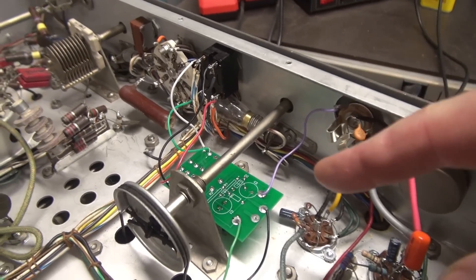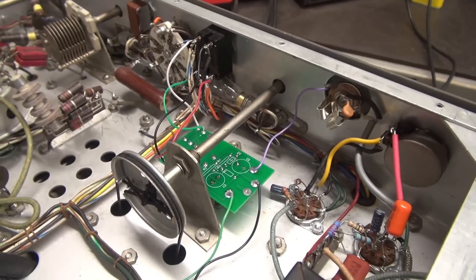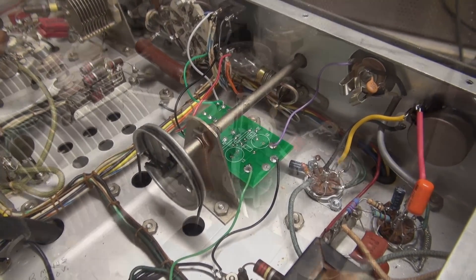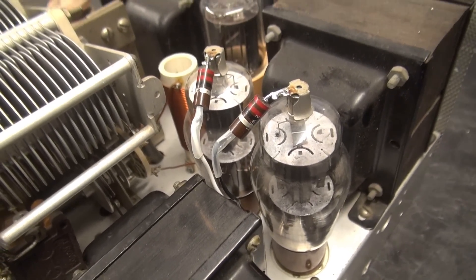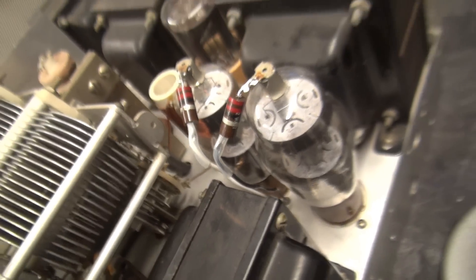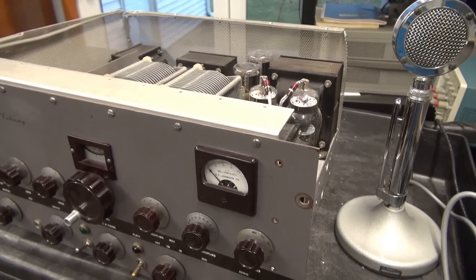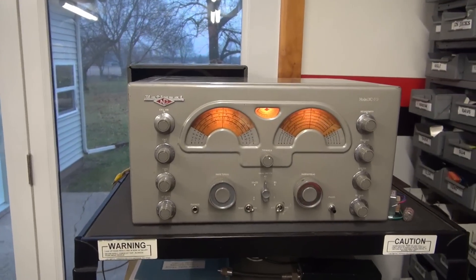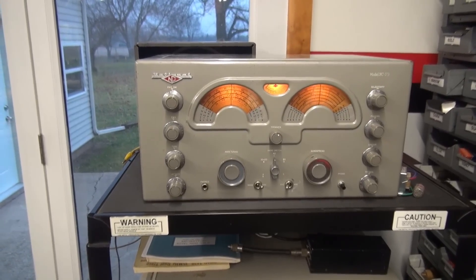The K1 module is all wired up, as well as the new microphone input jack. I did notice that the 807 plate resistors were missing — somebody had wired that direct and the wiring was pretty frayed, so I replaced it. Now I've got a microphone hooked up to the Viking 1, and for the test I've got a beautiful National 173 sitting here idling, waiting for that signal. Let's test her out.